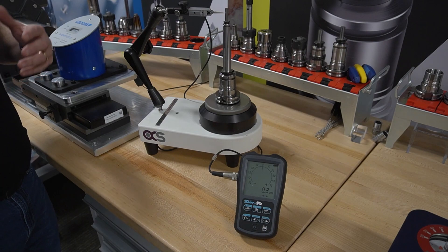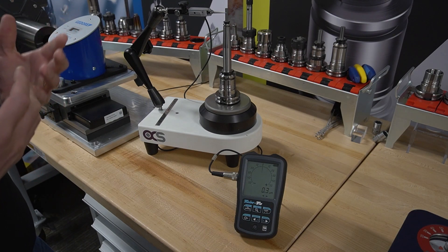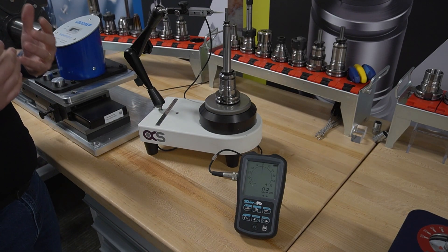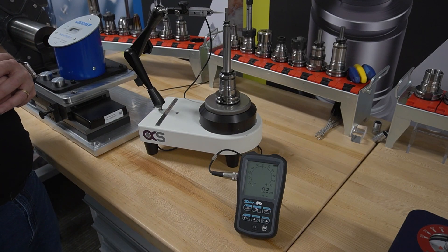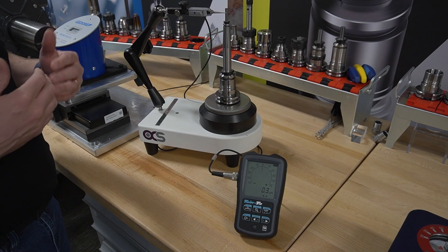Really happy with this. This did not take a whole lot of effort — just a little bit of cleaning and a little bit of time in the assembly process. These are the type of results you should be able to expect on a repeated basis. Very easy to get good TIR out of the power grip system. We are going to do this exact same thing with an ER assembly coming up in one of the next videos, so you can see what happens when you assemble ER stack-ups together.